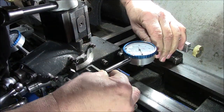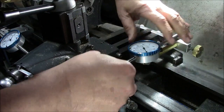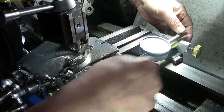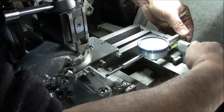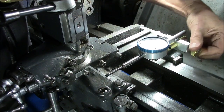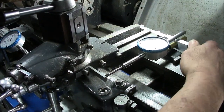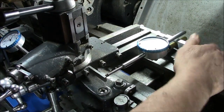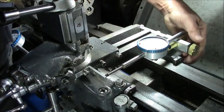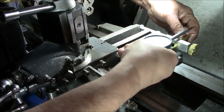Okay, here we're putting in the x-axis gauge — fitting it in, sliding it in, adjusting it a little bit so that it fits against the stop. The stop that you can see the tip of the gauge touching is actually just a little piece of angled aluminum under one of the gib screws. I took advantage of that location, put in a longer gib screw, custom cut it, and put a tip on it so it wouldn't mar the gib — and use that as the mating surface for the pointer.